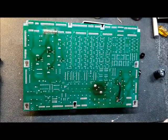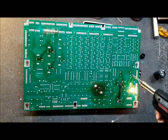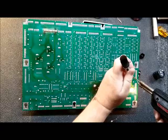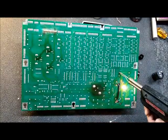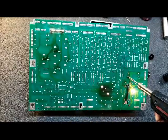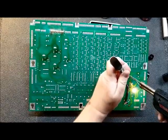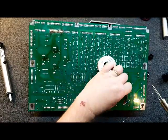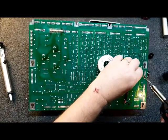And there's cap number one. And there's cap number two. Now you clean out the Chipquik — take the big chunks out with the sucker, and then generally what I do is I come back with a solder wick and just get the last of it.